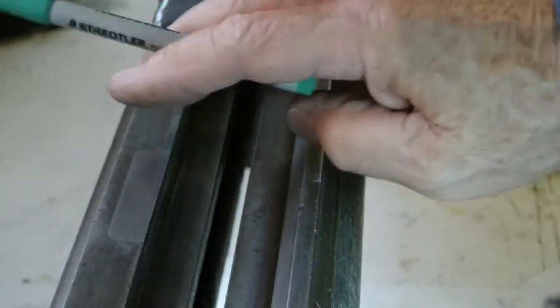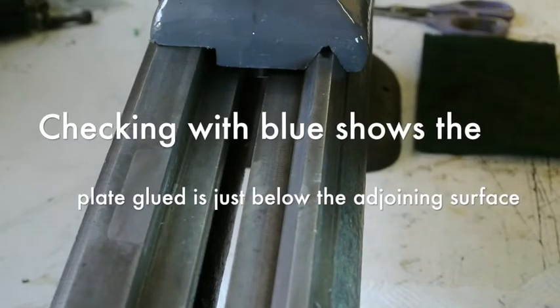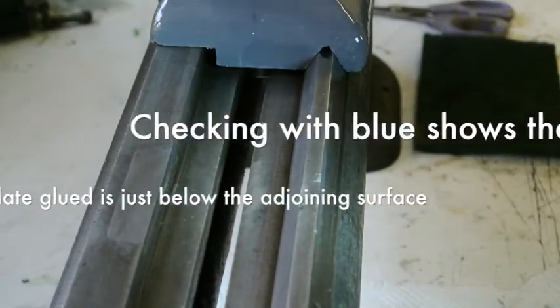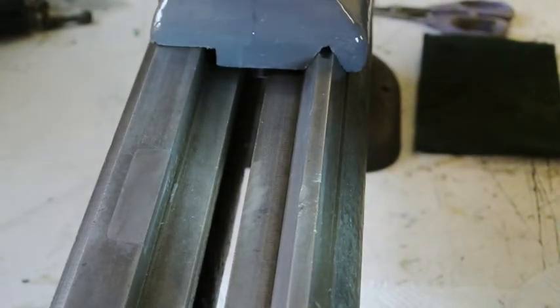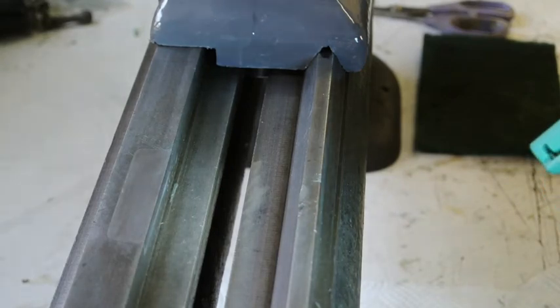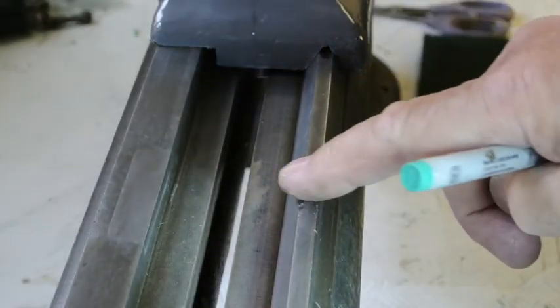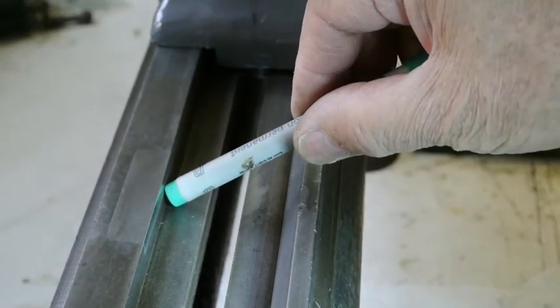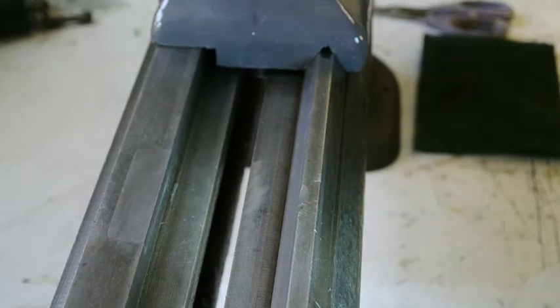On this surface I have got an intact surface all the way round and this is pretty flat. I will just put a blued surface plate on here just to do a print to check. With a straight edge it looks absolutely dead flush with the surrounding metal — so it mustn't be above it. I'll just scrape a little bit off until it is slightly level or slightly below. That feels really very good — I'm pleased with that. Annoying that there are these little burrs and things, but it's just cosmetic. It is an old lathe. And on the inside surface here it shows a little bit where the glue line is, though I'm not worried about that because when the lathe is in use it will never be seen.